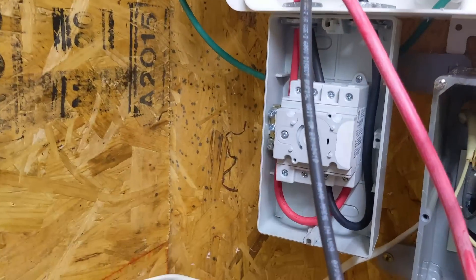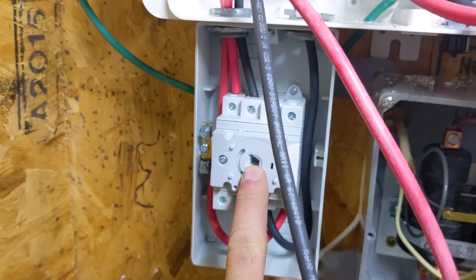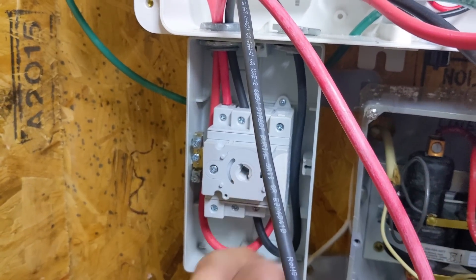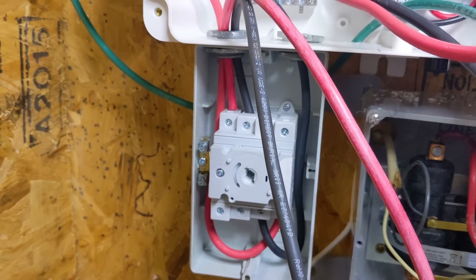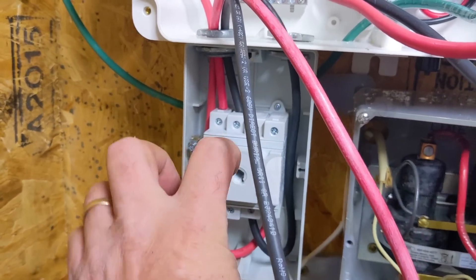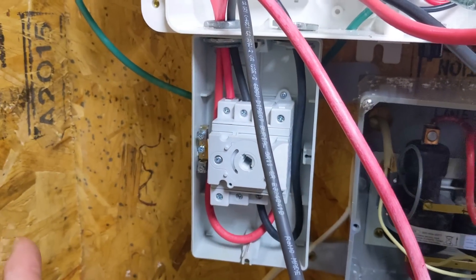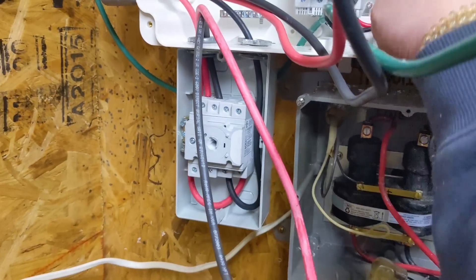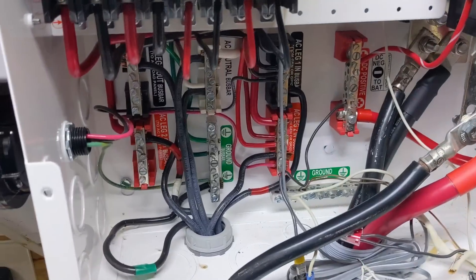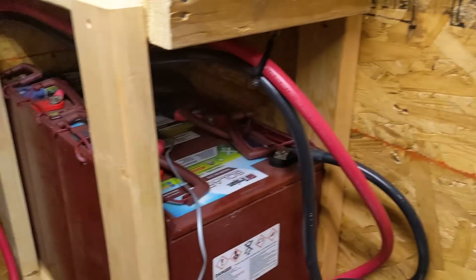What we're doing is: when we go off grid, we added an IMO switch to cut the amount of power in half coming off the roof. There are 30 panels, so when he's off grid he'll have the option to turn it off or back on if he's running a water heater or enough load in the house. When it gets blasted with the full 30 panels it doesn't sound good or act happy, so we're going to detune it for off-grid.